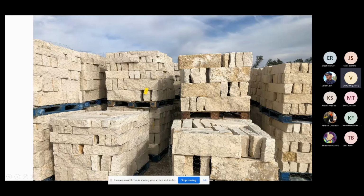So I'm going to show you in the next video, when you see our thin veneer getting loaded, the guy is just hammering the heck out of the stone. He's trying to smooth this bulge out. He's trying to hit it from the side where the dry line's going through it, so it gives it a nice smooth surface to lay up against the conveyor for the thin veneer. So you get a good piece that's about 1.25 inches thick from one end to the next.